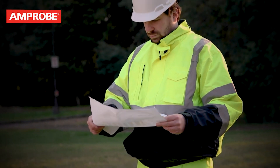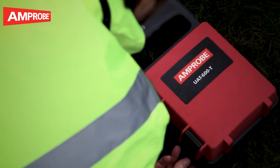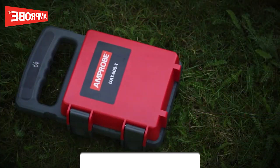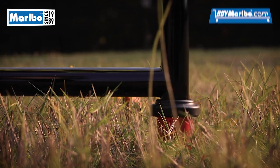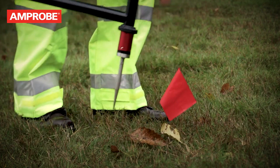To successfully find the location of a ground fault, use the optional UAT 600 A-frame accessory in combination with the transmitter in direct test lead connection mode. The A-frame in combination with the transmitter will pinpoint the place where a cable metal conductor — either a sheath or a metallic conductor — touches the ground. It will also detect other conductors-to-ground faults such as pipeline coating defects.